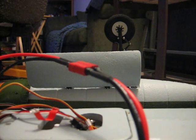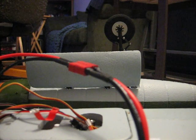No delay, no brake. If you want to brake, leave it at half throttle until the little music plays. At 1 beep, drop it to 0. It'll give you a couple confirmation beeps. You move it back up to half throttle. It's going to beep once, drop it back down, and it should clear itself out. And then every time you kill the throttle, the prop should stop dead on.